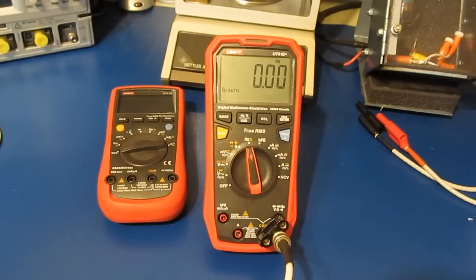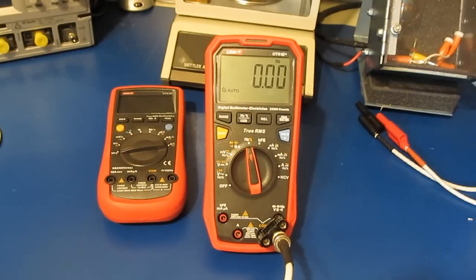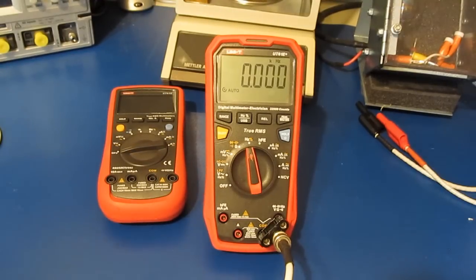128 meg, and you can see the signal's dropped off. We probably have to increase the amplitude a little bit. So currently that was with a 0 dB or 0.3 volt signal. Of course, we're unterminated on the meter end. Let's go ahead and turn this up just a little bit. I'm currently at 20 dB drive, and the meter is still unable to pick this up.